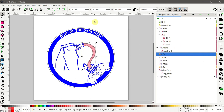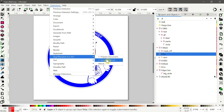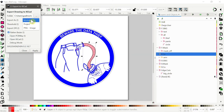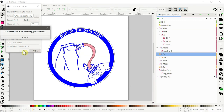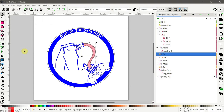I've now turned everything back on. We have our whole design with all the different layers — the text, the thief figure, the pants, the circle around the outer edge. In the mask layer I have the phone and the arm. In the copper layer I have the arm and all those little ribs. Then I go into the extension and do export. The key thing is to make sure 'flattened Bezier' is set and to export as a module — not a project or PNG — so we can attach it to our existing schematic. We click apply, and depending on the complexity it finishes in a couple of seconds, creating a footprint object with all this detail.